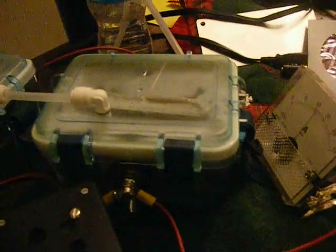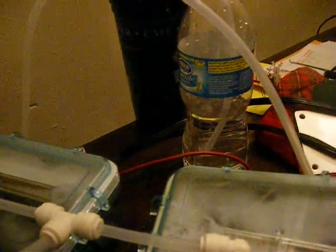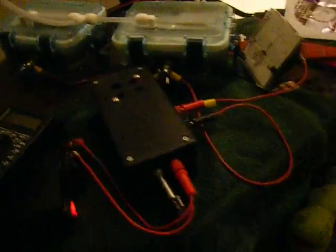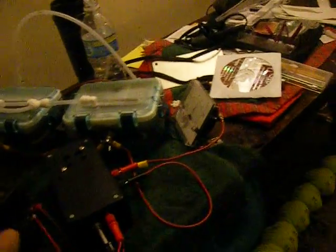Let's electrocute myself one more time — put that back on. Make sure that power supply is loving it. Adding another 10 amperes of current to that would be interesting; we'd probably hit about maybe 3.1, 3.2 volts. Production blows. But this is a first test — it's meant to record everything, all the data. The best part about this is you gotta realize that this cell is seeing less than 3 volts. They are seeing about 7.5 amperes a piece, and I'm pulling right about 5 amperes from what would be the vehicle's electrical system. So right here it's an interesting apparatus as far as efficiency is concerned.